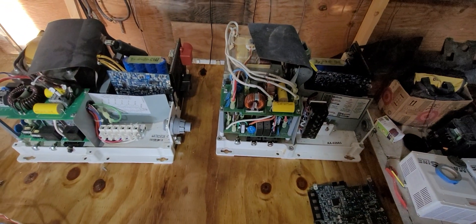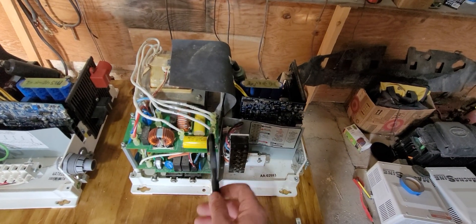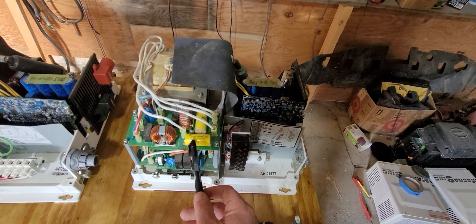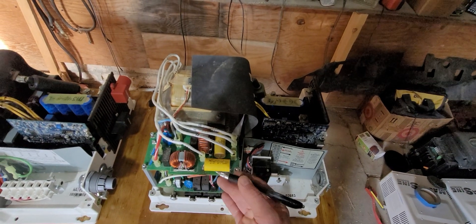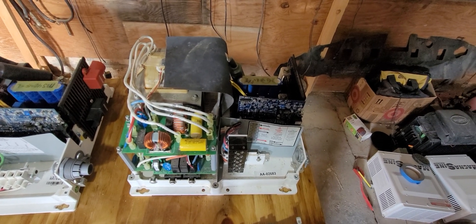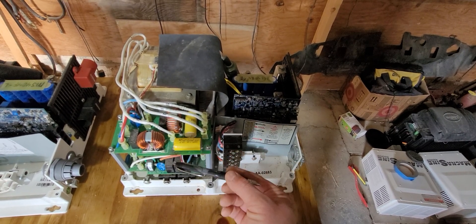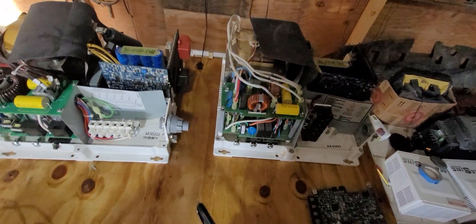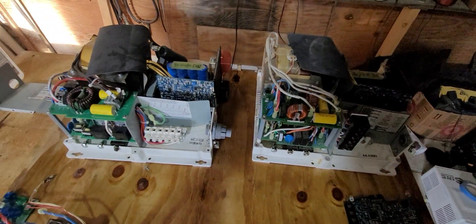I'm able to take the AC board and the AC filter board — and I guess this would be called the relay board — from this older unit and move it over to the newer 48-volt model. Pretty handy. It blew out a filter cap on the AC board from a lightning strike; it had a hole right in it blowing outward to the case. The owner decided to replace the unit versus repair, so I ended up with it on trade. I swapped out the filter cap for a new one, so I got that board fixed.